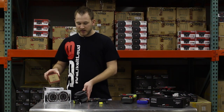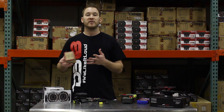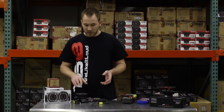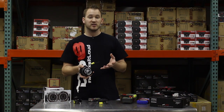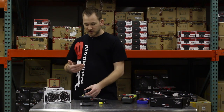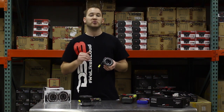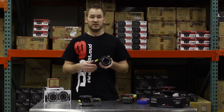These tweeters operate typically from 2,000 Hz up to 20,000 to 25,000 Hz. A lot of times when people install them, they're playing frequencies way below 2,000 Hz. You're going to see on all these tweeters that they come with a yellow capacitor connected to the positive terminal of the speaker. Some of them are different sizes depending on the tweeter size, but they all serve the same purpose. A lot of people disconnect these because they're not sure what they are, and it's really important that you don't do so unless you have other things in your system to replace them.